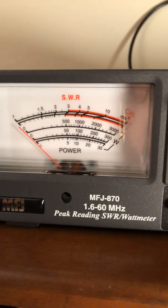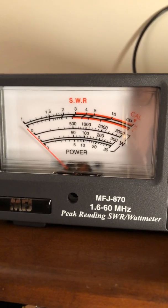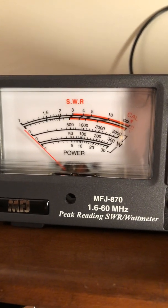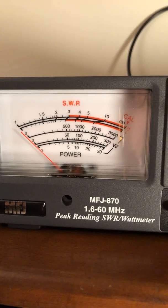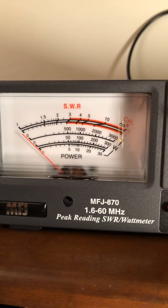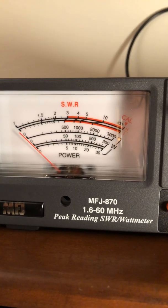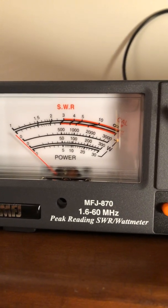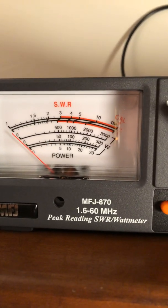With that audio, you can see it went up to about 22 watts — so the swing was up to 22 watts. With amplitude modulation, that basically means your voice rides on the carrier wave, but in order to be heard you need to speak into it. The louder you speak, the better. I'm not suggesting you scream and over-modulate, because on the other end somebody won't be able to hear you clearly.